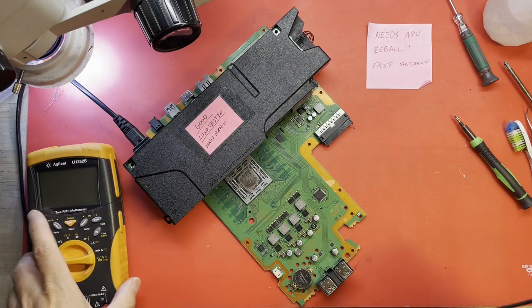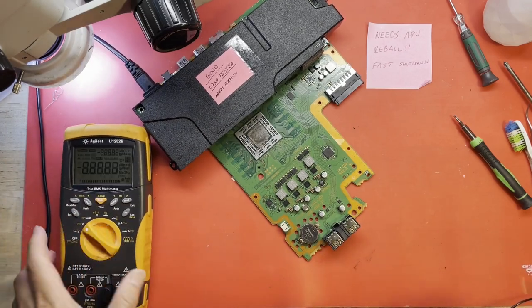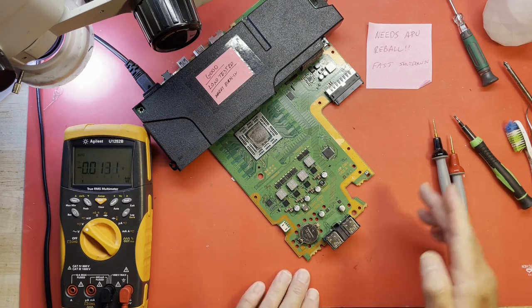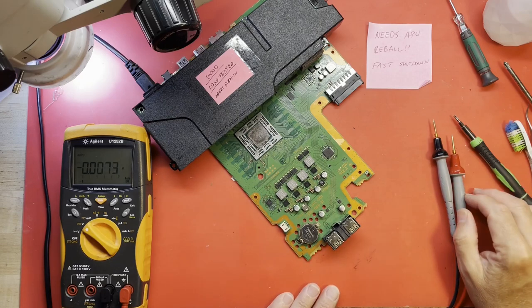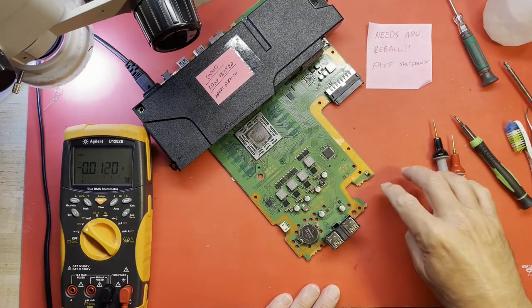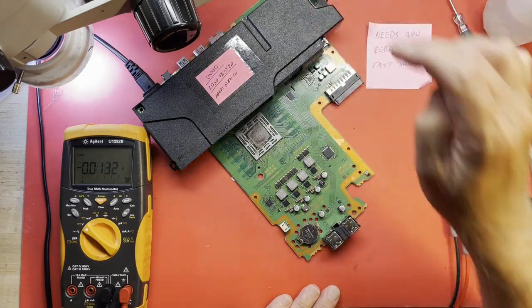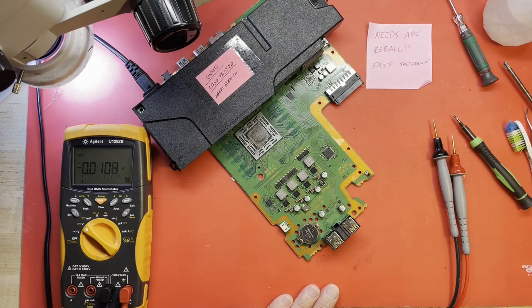If you have one that's shutting down like that, you need to kind of confirm some things, such as, one of the reasons a PS4 would shut down like this is if the 12 volts is not coming up. You know, these supplies have a separate 5 volt standby, or 4.8 is what it actually runs, on these four wire leads, just a separate 4.8 volts, so that they can have enough power to beep and make the light flash. But when you press that button, you get a signal from, I think it's the syscon, to turn on the 12 volt rail. And if that does not come up in a timely manner, you're going to get that same effect. You get a blue light off.